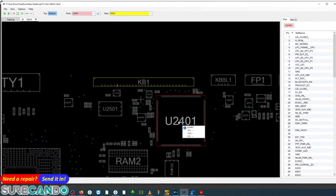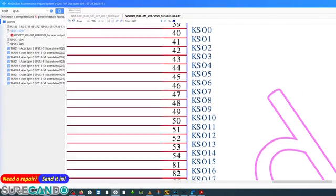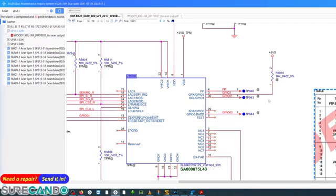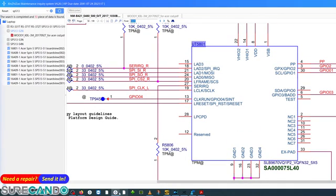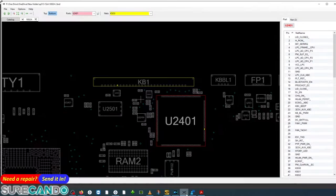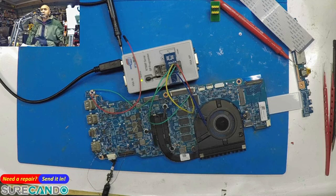One more thing: I'll show you some schematics on the super I/O. In this specific schematic it doesn't actually label what those pins are for. Anyway, going back — you basically need to know which pins connect to the keyboard connector. You can also use continuity mode on your multimeter to find the link.